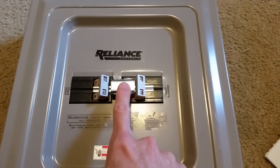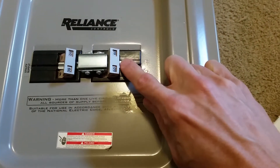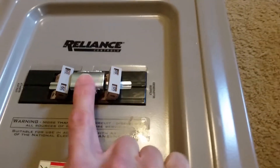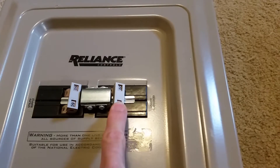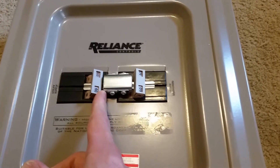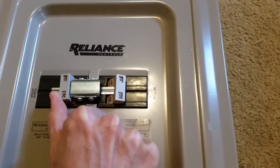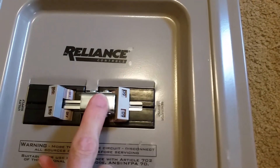They're attached with a piece of metal that sits inside a groove between the two poles of the breakers. This piece allows — or rather forces — you to break the power source on one side before you make the connection on the other side. So it's a break-then-make physical connection between the two breakers. You can push one side so both go off, or switch them one at a time. It slides in the groove so you can't turn both on at the same time.